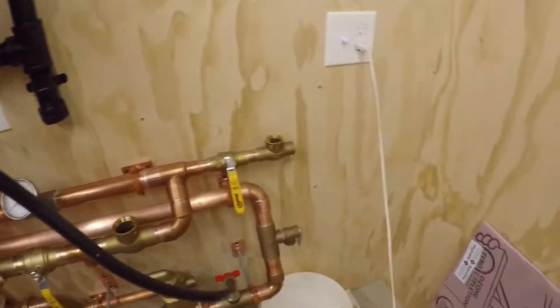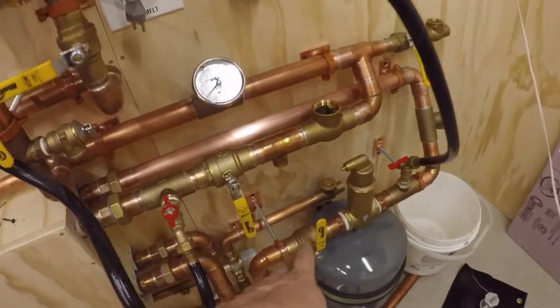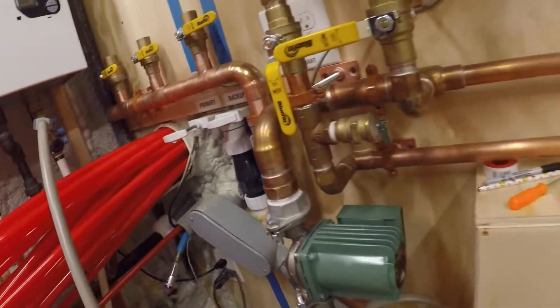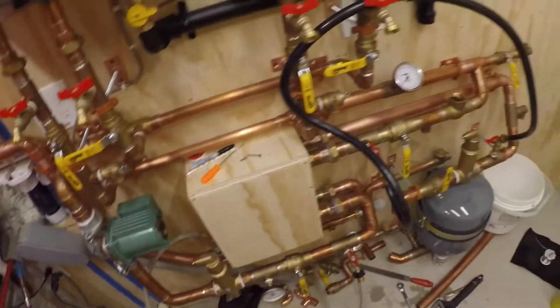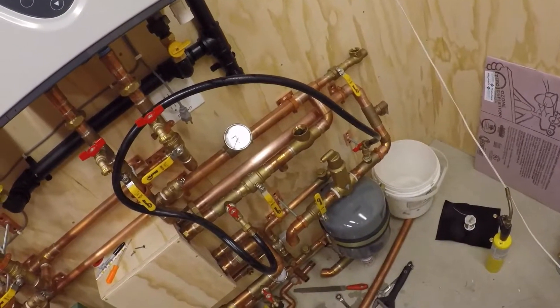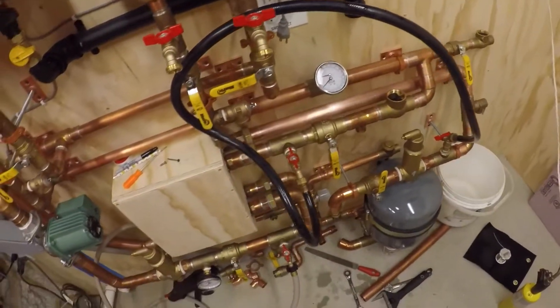After retesting, I have about 45–50 pounds coming in from the street. I quickly learned this system is 30 psi max. I went to shut off the supply — I'm stealing cold water from my isolation valves for my existing tankless as a quick connection — but I shut that off without thinking, and sure enough I blew the pressure relief valve because it hit 30 pounds. It scared me — I thought the tank exploded — but it was just the PRV. After that I watched the gauge and kept it right at about 28 pounds.